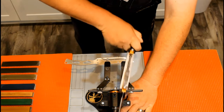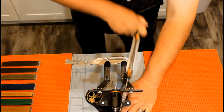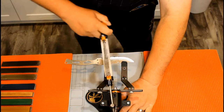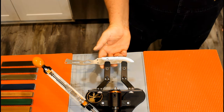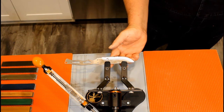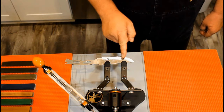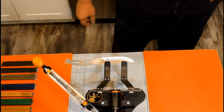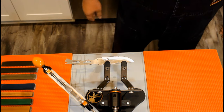Stopping frequently will allow you to see and feel how the blade edge is shaping. After you gain some experience, this will allow you to work more efficiently by adding additional pressure in some places while letting up in others as you make your passes. A burr has formed at the tip. Just to be clear, the burr is the blade material you have filed from the edge using your stone. We need the burr to be complete from tip to hilt. It is not important that the burr is an even thickness. It can be larger in some places and smaller in others. I use my fingernail to check the burr. Some guys use the pad of their finger. Try both. See what works for you.